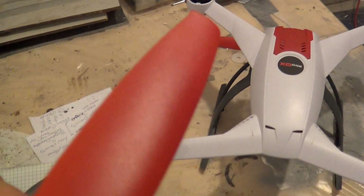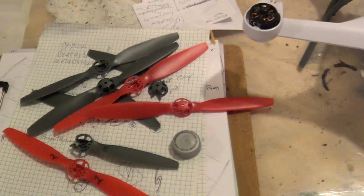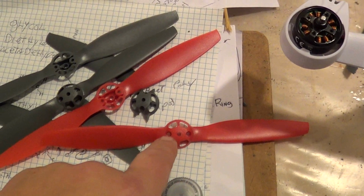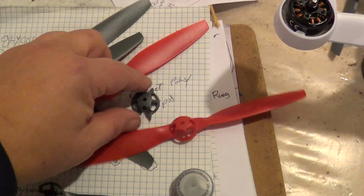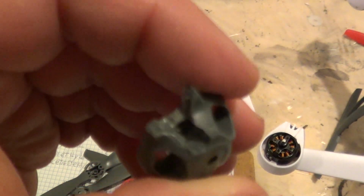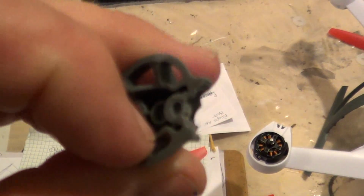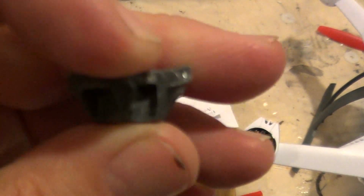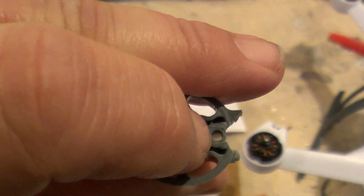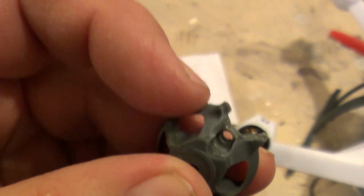That sheen, see that sheen? That's low density plastic. It'll bend all day and it won't break, but it will break where it's weak. There's the weakest link. See that? There's your weakest link. That's where it breaks, at the high density plug. There's the high density plug in it right there, that little round circle. I could pop that out and it will not stick to this.